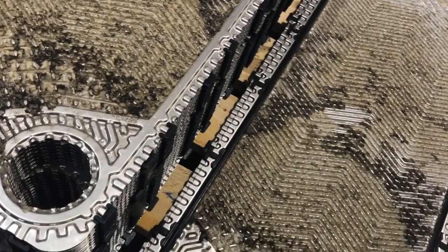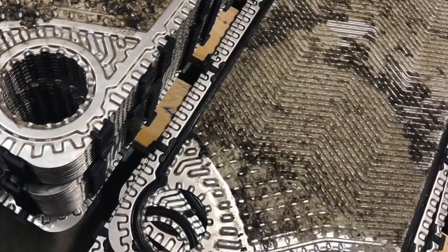In these cases it is enough to open the exchanger, replace the gaskets, close it, perform a pressure test, and the exchanger is ready to restart.